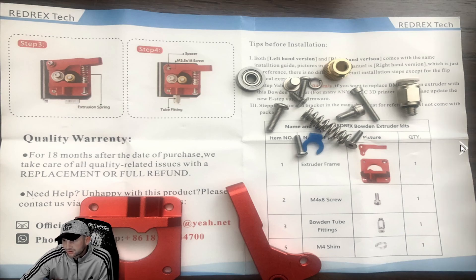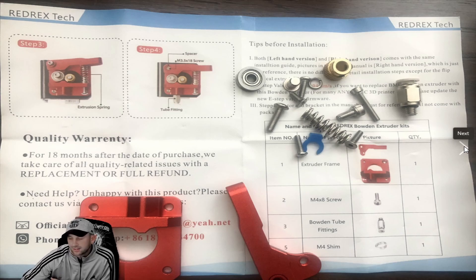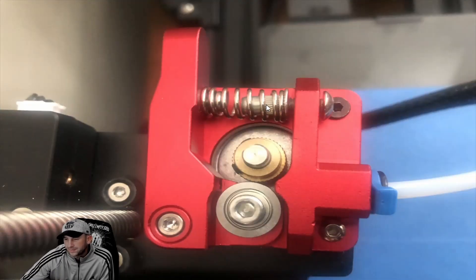This is the component showing it all in pieces. You'll see here's the spring — we'll go to the next picture and talk about the spring and the tension. Here is the MK8 extruder, almost the same as the other one. You'll see the screw here — this is the tensioner, and you can see it's tensioned a little bit with a small gap. As it pushes on this little pin, it pushes the screw either tighter or looser depending on whether you're screwing it in or out.